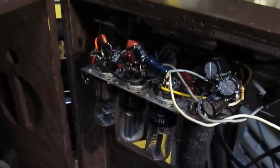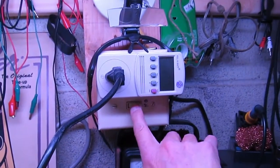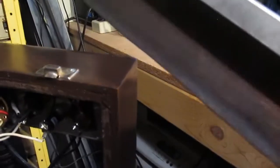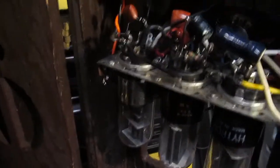I've got that off. Let's give it a shot again — turn the power on. Still shorting out on the current limiter. There's about a dead short here. Maybe that piece of metal is possibly shorting out against something.